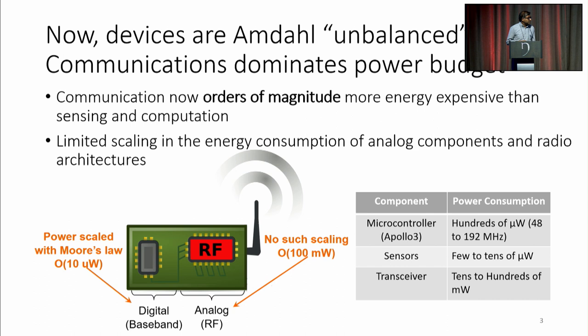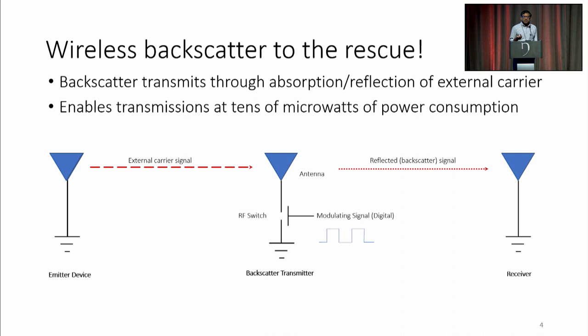This is why, more than a decade ago, folks were very excited about wireless backscatter solving this problem, coming to the rescue, so to speak. It turns out that the key to backscatter is that you're reflecting or absorbing an externally generated carrier signal. The cool thing about this is you don't have to burn all the energy generating it. The bad thing is that there's a problem with range. The reality looks more like this: you have an emitter right next to your backscatter device, and the question you have to answer is, in what setting am I allowed to be a meter away where I can't run a wire to power my device? This has been the Achilles heel. On the bright side, being able to modulate a signal simply with a digital signal allows operation in the microwatts regime.